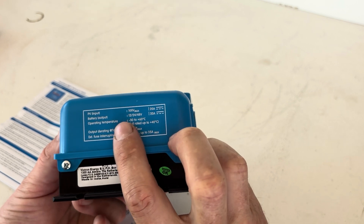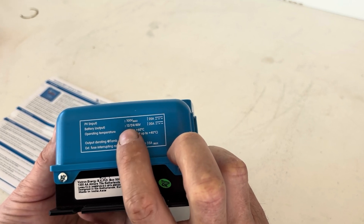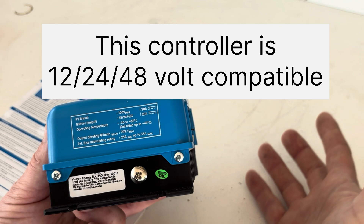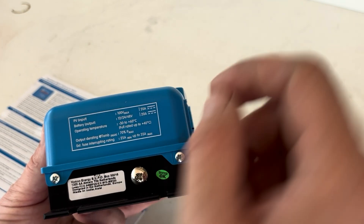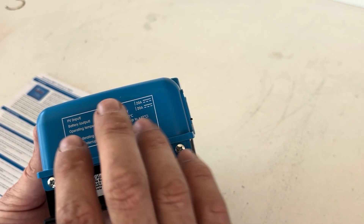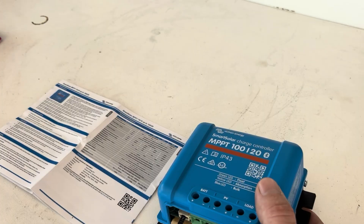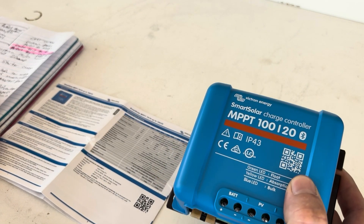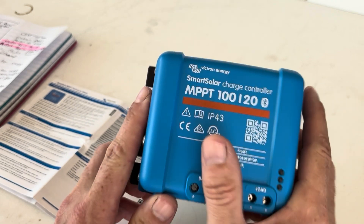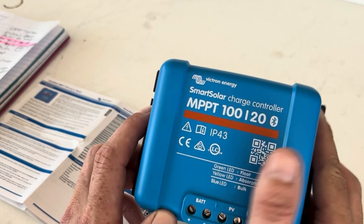One of the main reasons - and it's an important reason - why this is a perfect beginner-friendly charge controller is the 12, 24, and 48-volt options, and this is all automatic. So if you hook up a 24-volt system, it will automatically detect that. Simple, easy, don't have to worry about it. So if you ever wanted to upgrade your system, you don't need to throw out this charge controller. There are advantages to using a high-voltage system, such as charge efficiency - you can use a similar size controller and get far more solar panel input into your batteries. A lot more efficient.